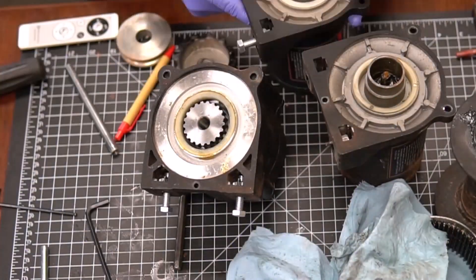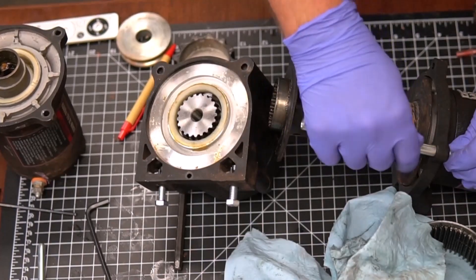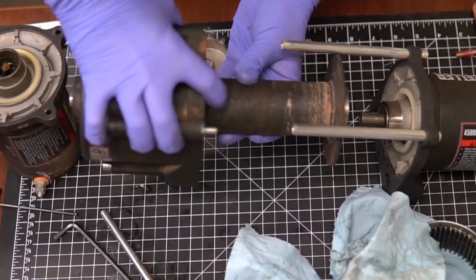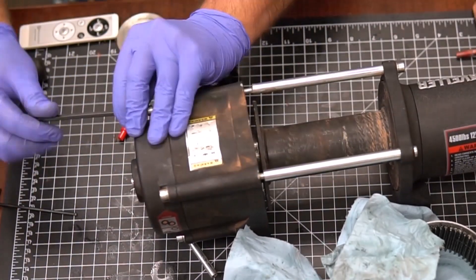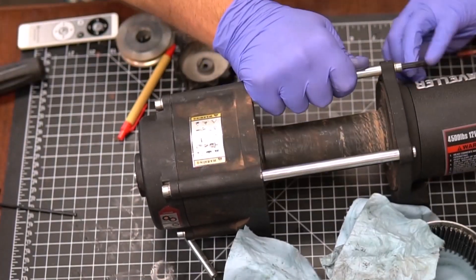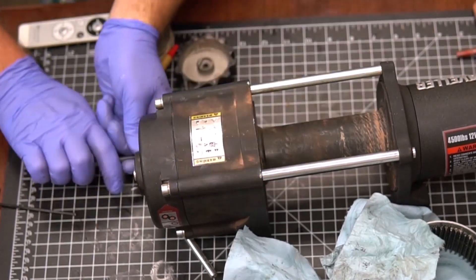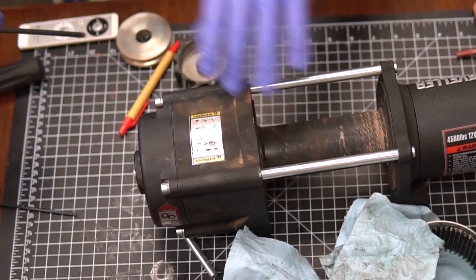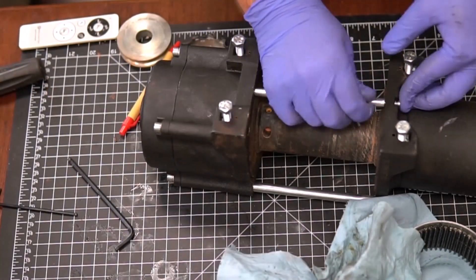This thing has just continued to be a workhorse from that point forward. It's pretty amazing that I was able to put this thing together inside SolidWorks in 3D to really understand it. If I was an expert in gearboxes, I probably wouldn't need to model it to understand how torque gets transmitted through all the various stages. But once I got it into SolidWorks, I was able to analyze the motion, check for tolerance stack-up problems, and ultimately realize there was just poor engagement — whether a part was built wrong or the housing was too big. The easiest fix was to create a small shim, reassemble it, and everything was back up and running. I hit all my deadlines.